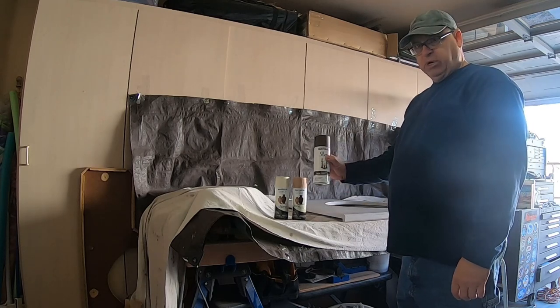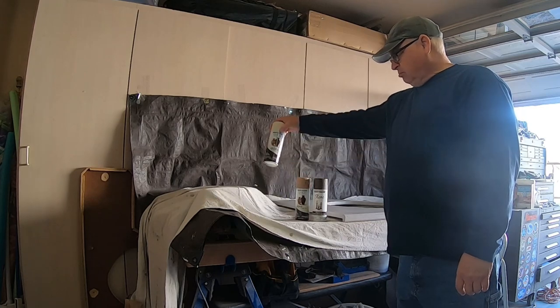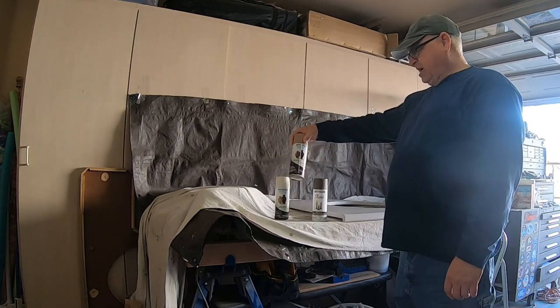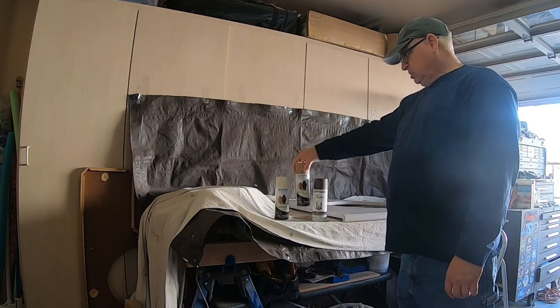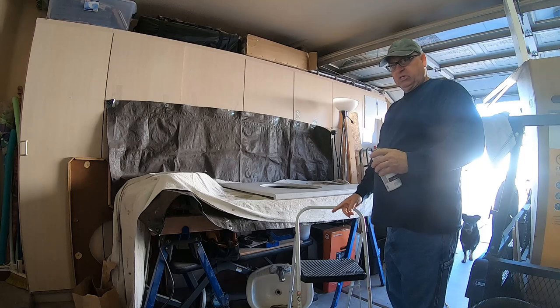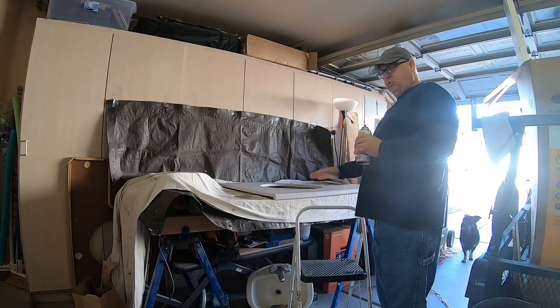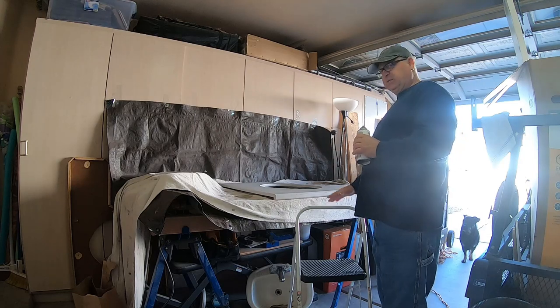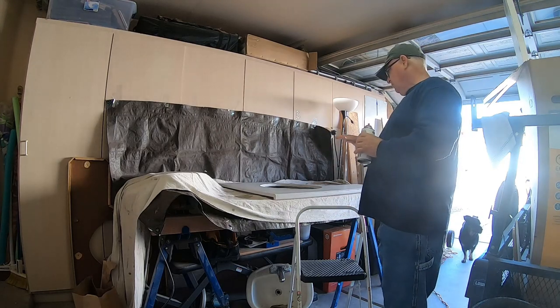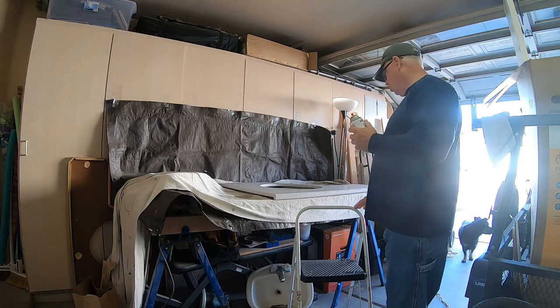At this point I'm going to start with the dark brown color, then follow up with the bleached stone, and last I'm going to do the sienna. I'm using a step stool so that I can get high enough — about 16 inches above — to give it a nice speckle. If I'm too low, I'm going to get way too much material and I don't want that.